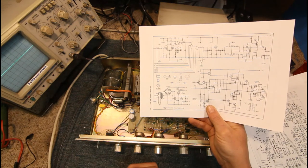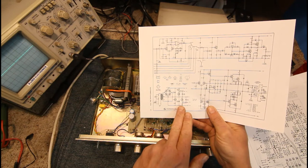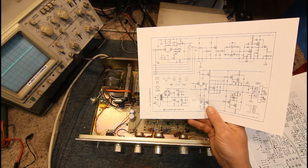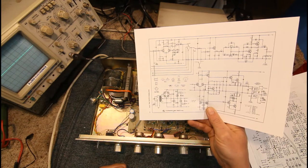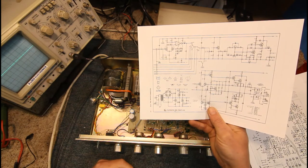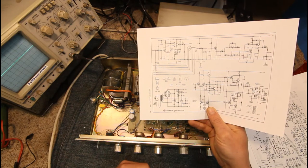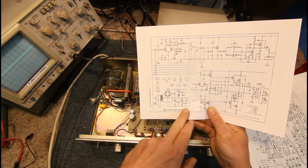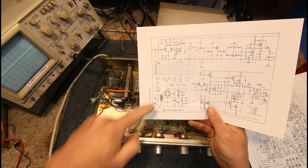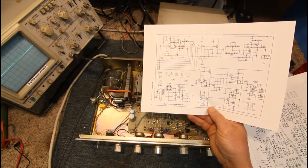This is 25 watts a channel, so you need some voltage around that amount. The output of the amplifier is a much larger signal than the input — that's all to do with the amount of voltage it can swing. A bigger sine wave just has a higher voltage peak to peak. You start off with about line level, around half a volt peak to peak, and by the time it's coming out of the amplifier you might be getting up around 15-25 volts peak to peak, although with plus and minus 30 volts you could go up towards 50-60 volts peak to peak.